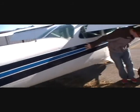Leading edges, no big dents or anything. As we come back here, flaps wiggle. Track looks good. Push rod's connected. And heading out this way, full movement on the aileron. Four screws, four nuts. Push rod's connected. Four screws, four nuts on the far outside there. Okay, outside here looks good. Our lights are intact.